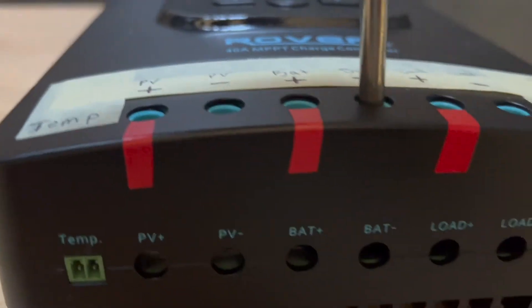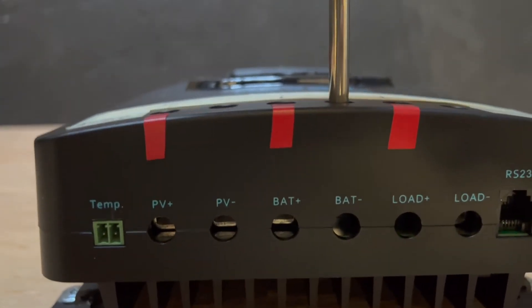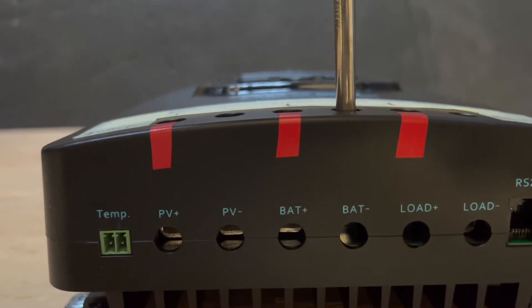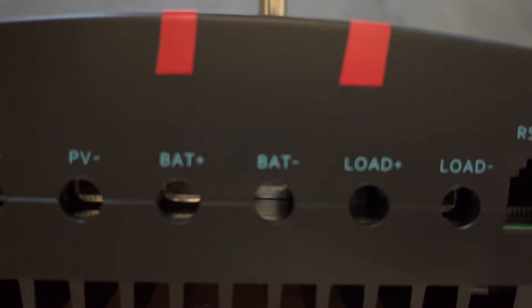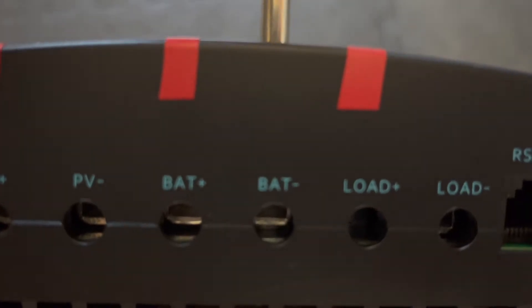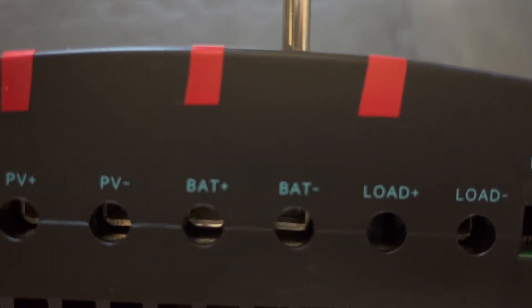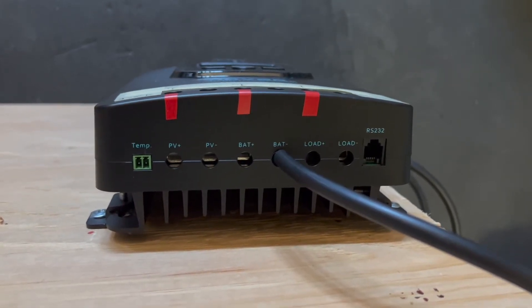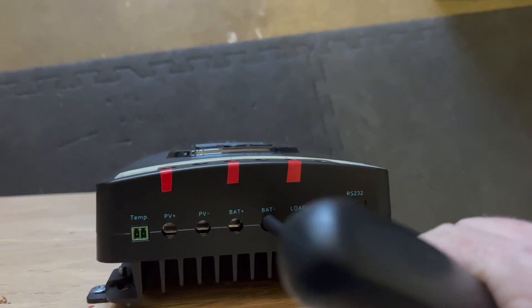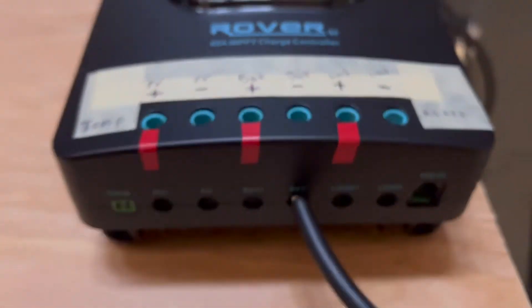There's a battery negative right here. I got a screwdriver to tighten it. It comes already tightened all the way up, so I stuck the wire in there, tried to tighten it, and it wouldn't tighten. So I have to loosen it down. You can see on the PV positive, PV negative — PV stands for photovoltaic, or the panels. They're all the way down. I lowered them down off camera, same with the battery positive. As I lower this, you can see this little tray slowly coming down. What I'm going to do is lower that all the way down, stick the negative terminal in there from the battery, then tighten it. When I tighten it, the ledge goes up. I'll tighten it off camera because I need two hands. The negative terminal is in there — tightened up. I didn't over-tighten it; they warned about over-tightening because you break the mechanism. Just give a tug — it's not going anywhere. But I wasn't stripping the screw out on the top either. Just giving enough pressure to where it's firmly in there. There's no exposed wire.